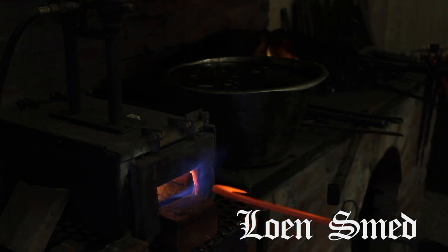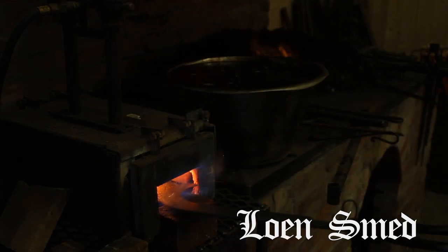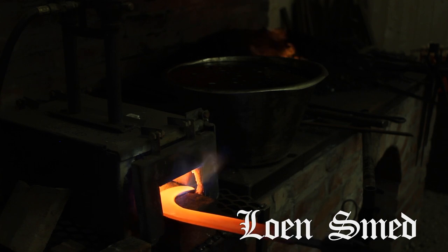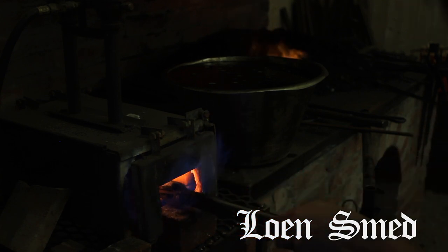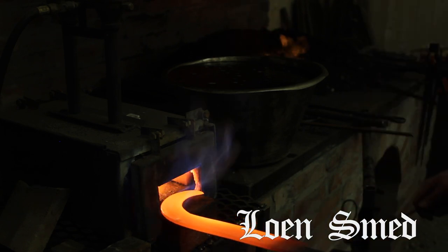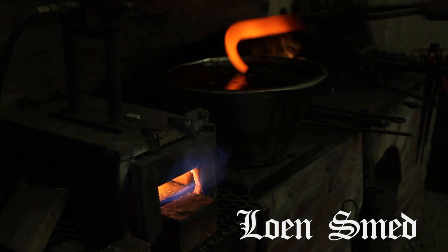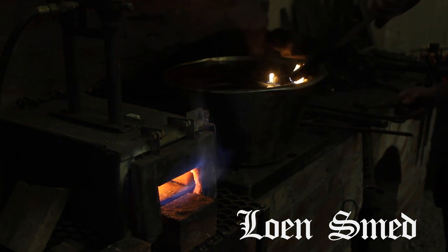I'm using the magnet here just to really make sure that I can dial in the color of the steel at what temperature it needs to be hardened at. Of course, when it comes to any kind of mystery steel where you don't have a proper data sheet, it's a lot more guesswork than science anyway, but if you take the time and do a little bit of experimenting, cut off a small piece and try it, it's a lot easier to make it right.